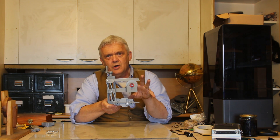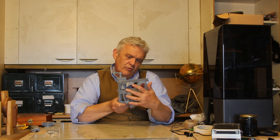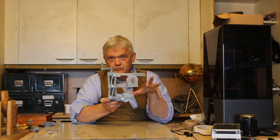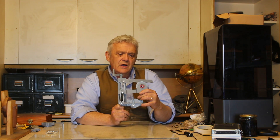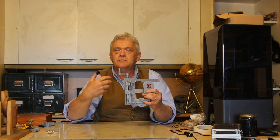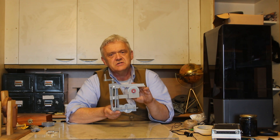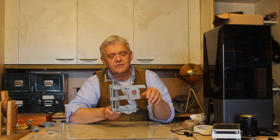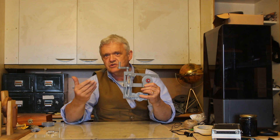You'll notice it's only working on the pull, so this only works half the time. What you do is duplicate the ratchet, pull arm, and scotch yoke on the reverse side — but offset so it engages on the opposite stroke — giving you pull for a full rotation. One unit will work, but you really need three. You get much better performance because the ratchets sum together, giving you the best output every 120 degrees across three units.